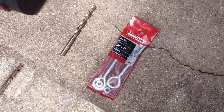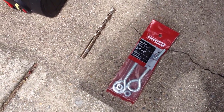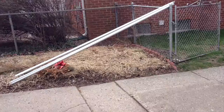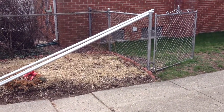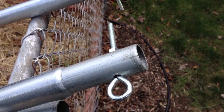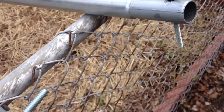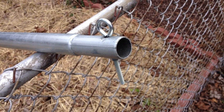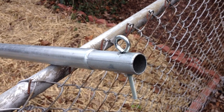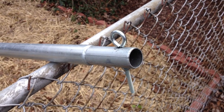I got the other post put in, and now the next step is to take a 5/16th drill bit and drill a couple of holes at the top of two of my 10-foot fence post sections to allow these eye bolts to pass through. I've got a total of four 10-foot sections, so I'll be putting these holes in the top of two of them and adding the eye bolts. The holes are now drilled and I put in a quarter-inch eye bolt on two of them near the top of the fence posts. I'm going to tighten it down with a wrench before the next step so they don't wiggle loose once they're up in the air.